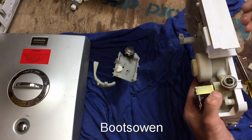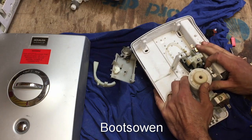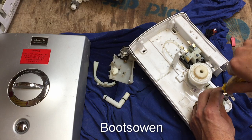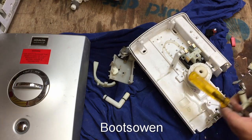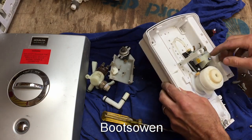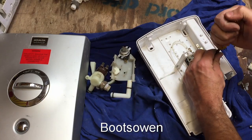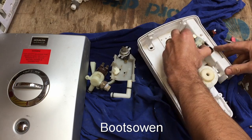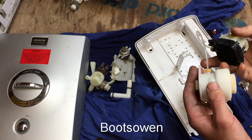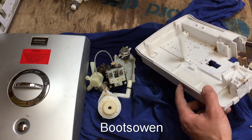This has to slide up - it's locked in position, it has to slide up to get it out. You wouldn't know that if you hadn't done this before, if you had it stuck to the wall. Also there's another screw hiding in there. Here's a little elbow of pipe. That's the inlet solenoid valve, very similar to Triton's - maybe not the same though. There's another really rusty screw down here - that's what's holding it all on. So that's your flow regulator and a pressure switch as well. So that was the AquaLisa AquaStyle.